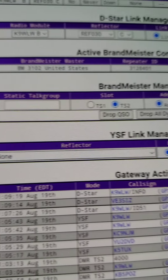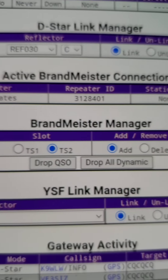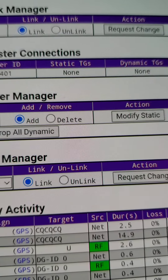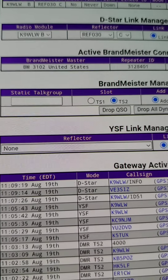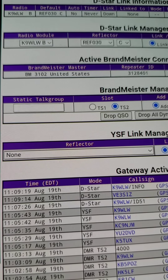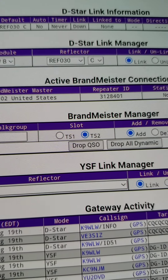You'll notice I only utilized one digital mode at a time even though the switch is on for all three modes. All it took to get into a mode was a radio command from the type of radio I wanted to use. I keyed up a talk group with the AnyTone to activate DMR, hit group call 4000 to get out, waited 20 seconds, then used a Wires-X command with the Yaesu to select a YSF reflector, and unlinked by pressing and holding the band button.